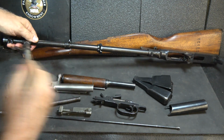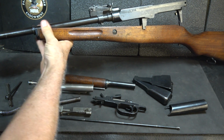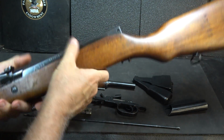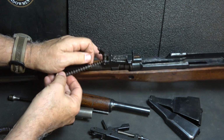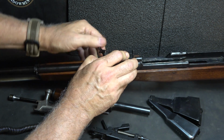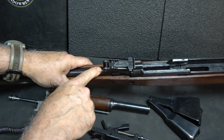And so I'm going to bring the bayonet around, and we're going to put this right here. Best way to do it is get up here at the front and then just close it in. Lock that down. Okay, we're going to take our rod, put it in the spring, put it right under the sight tower. This little lever needs to be in place to allow for the head of that pin. Then we're going to bring it over like that, and that's under spring tension.